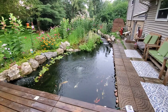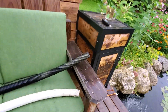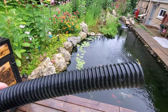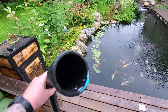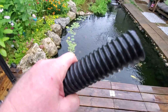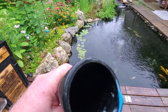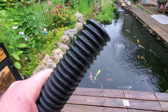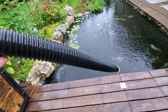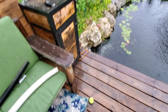There are certain steps you can take, knowing that a system is going to fail, to mitigate your loss. The first thing is that a lot of people use this corrugated ribbed piping right here, and it's garbage. I will never use this stuff outside of a pond. It's readily available, cheap, light, and flexible, which makes it attractive. But the problem is these PVC ribs are just there to hold its shape — the actual wall thickness of the plastic is a sixteenth of an inch, and it's a soft plastic. You can literally take a screwdriver and punch a hole right through these ribs. I only use this stuff internally inside a pond, so if it fails there's no loss because your water is still going to be in the pond.